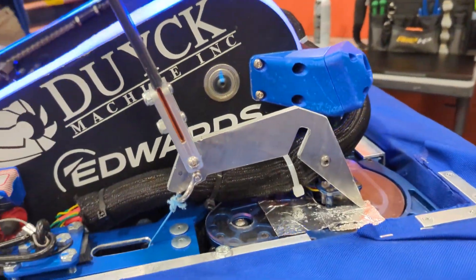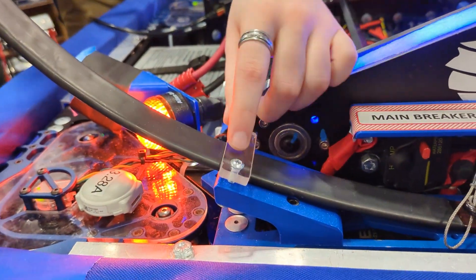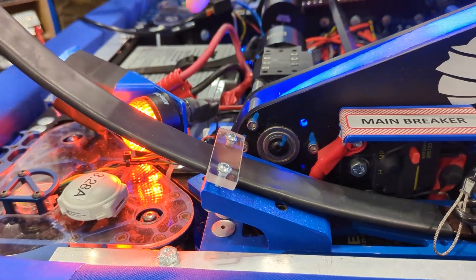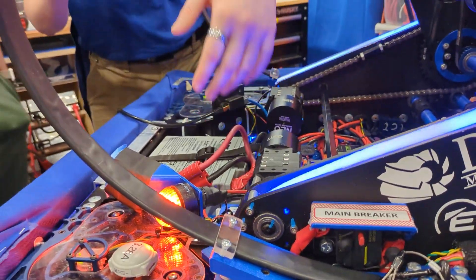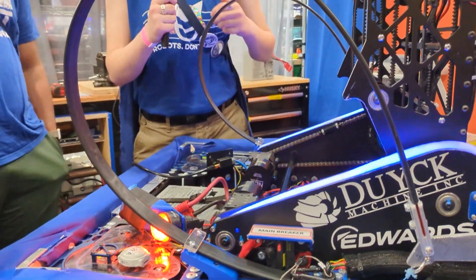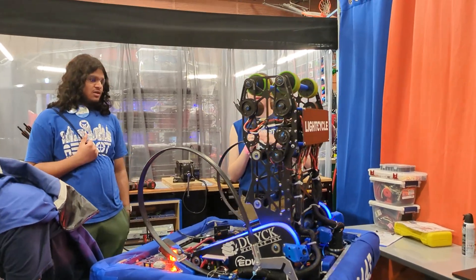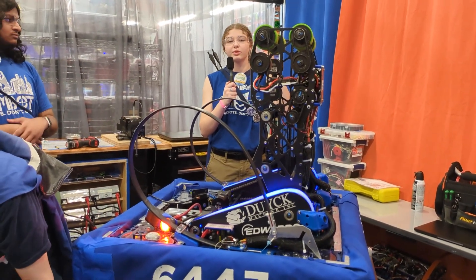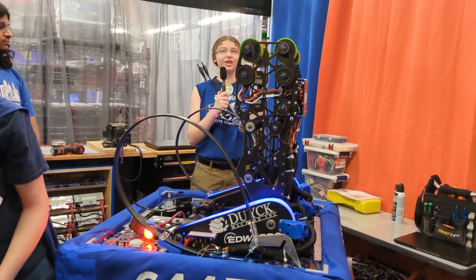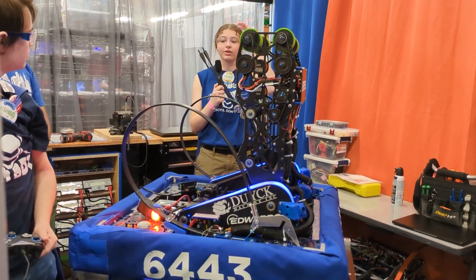For rigidity of the fiberglass rod itself, we have wedges at the bottom with a polycarb lock on top that keeps them from swinging around. This wedge also pushes up the angle of the fiberglass rod to make sure we can achieve harmony climb with other robots. We have a whole sequence with the pivot to move it into a position where we can reach underneath the chain, and then it swings up to a horizontal or vertical position so that when it climbs up the stage it hangs at the right angle and we're not touching the ground.